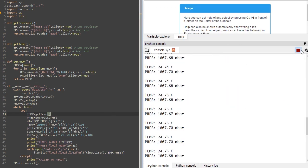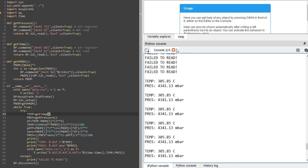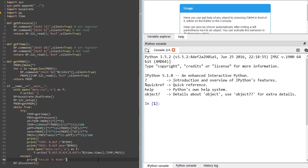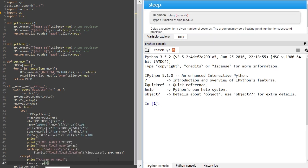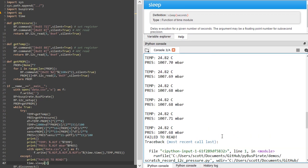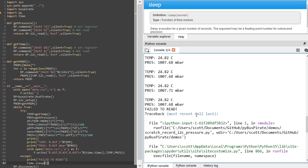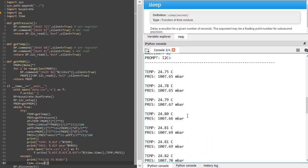I'll use Ctrl+C to stop the output and scroll back up. The program continuously reads temperature, pressure, temperature, pressure. I'm going to hold the temperature sensor in my hand; you should see the temperature number start to rise. I'll also put a little pressure on it by pushing my thumb on the syringe. After letting go, it's a large thermal mass so it doesn't surprise me it's still heating up. That's enough to show what we're trying to demonstrate.